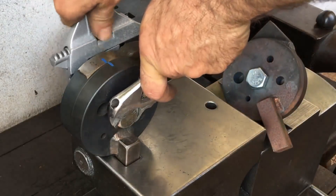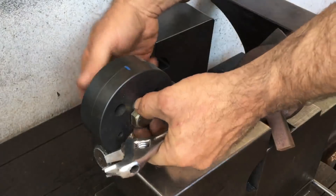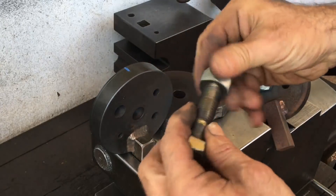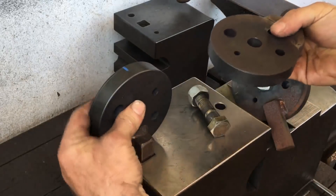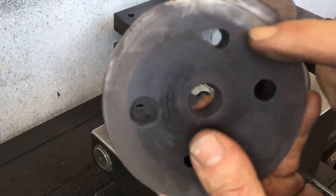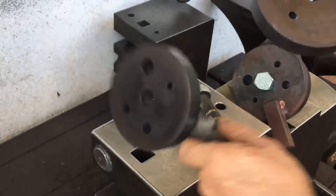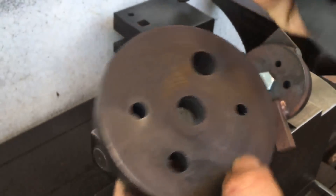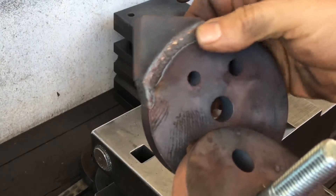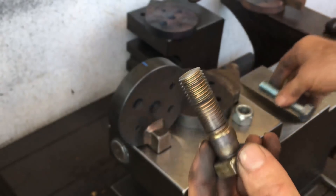I've almost exclusively used this to cut my eight millimeter stock. Examining the hole, it's still really crisp at the edges and doesn't show much wear and tear at all. You can see I didn't weld the inside there where the strike plate connects to the rotary part — the hole edges are just still really crisp. I've had the inside of this one welded. This bolt I've been using is not quite right; the unthreaded area is a little bit too short, so the threads have been worn down there from constant use.